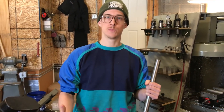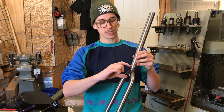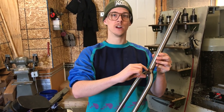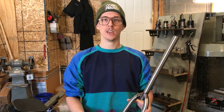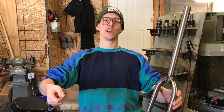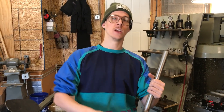If you're building a cross bike or a road bike and you're going to supply your customer with a beautifully made unicrown steel fork, but you want them to have the option of switching to a carbon fiber fork — what I found when trying to design a bike to work with both is that you have considerably more stack on a steel unicrown fork than with a carbon fiber fork from any mainstream manufacturer. They're going to be a lot shorter. So you're going to have a hard time designing the front end of the bike to handle right for both. When you're talking custom bikes, you're talking refined geometry. To raise and lower the head tube of the bike up by 15 millimeters or more really makes a huge difference — the height of your hands, and when you lift up the whole frame with a longer fork, you're changing the head tube angle and the seat tube angle, your bottom bracket height off the ground. Everything gets pivoted up and backward.